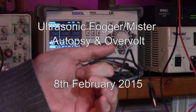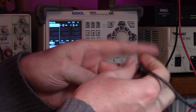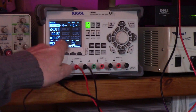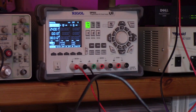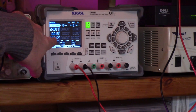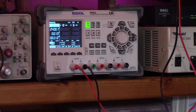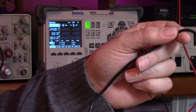I'm going to hook them up to this power supply and see if they're pulling any current. I've actually done this already so I know that they are. If you turn it on and give it 24 volts, you can see it's pulling 13 milliamps. If I drop it in a cup of water, you see it intermittently switches between 40 milliamps and 13. So there's something going on in there that can clearly still detect whether it's in water or not.